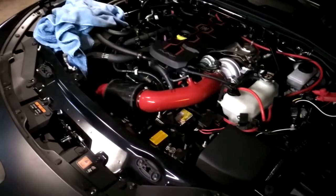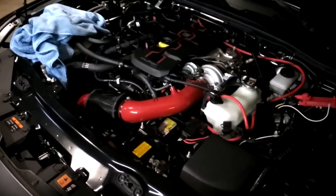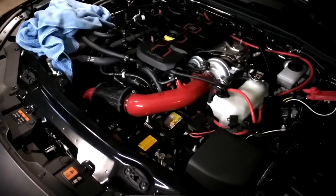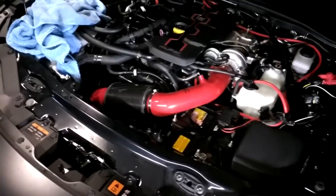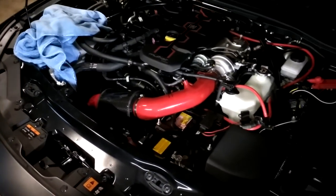In any case, I think that it's two gallons per hour at some pressure value below the pressure value of the pump. The people that make the nozzles probably aren't talking to the people that make the pump, because this two-gallon-per-hour nozzle flows 3.8 gallons per hour. I've checked other ones, and they're all off like that.